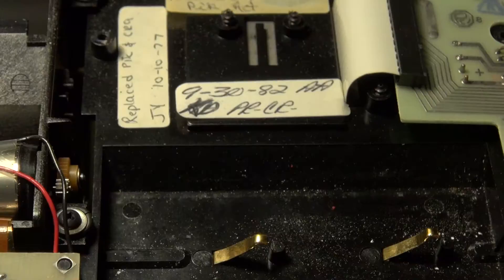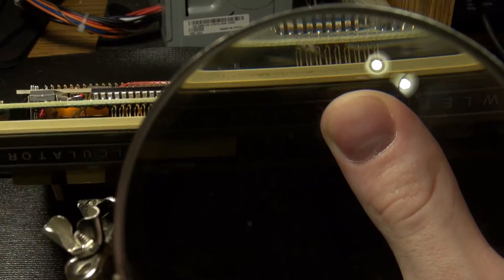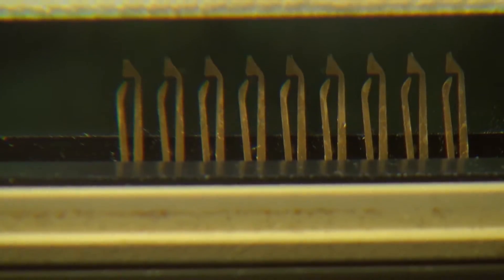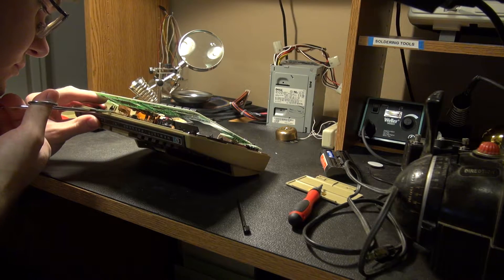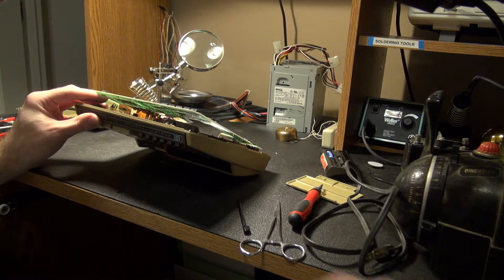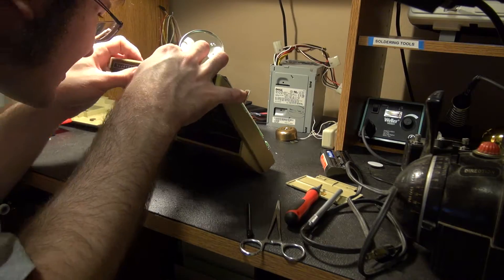So this has been repaired several times. Let's take it a farther level here. What we're looking at are the strange springy clips that go through the plated vias on the board to make contact to the other board, instead of using regular 0.1-inch headers. I'm working on this one pin or spring clip that has been bent and broken. I'm trying to get it back in place, first using hemostats, then using an exacto blade, and eventually I get the pin bent back into place.